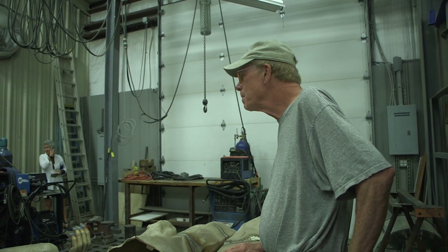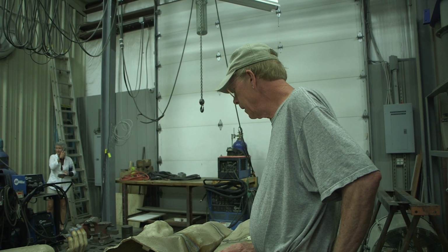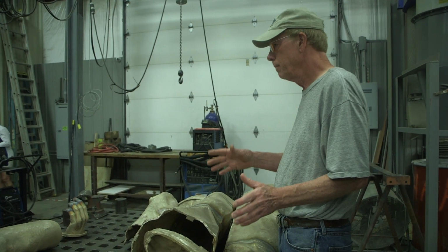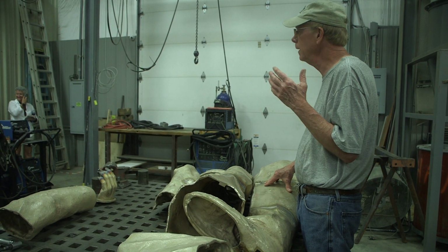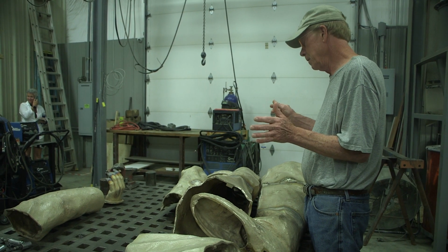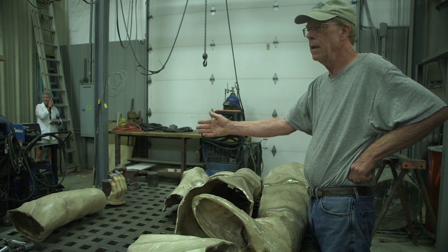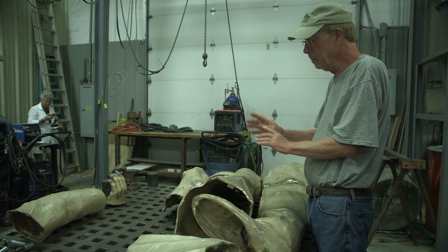When you bring it up, do you bring it up as one whole piece, or do you bring it up in pieces? You mean the assembly of it? Assembly, yeah. Well, we'll assemble the legs and the hip area first, and then because it's in a public place, we like to make sure everything's good and strong. You never know. Public can be mean. So we put a stainless steel pipe armature inside the legs with a crossbar at the hips, and because he's got his arm out, it'll go up through his shoulder and down through his arm so that he'll withstand anything.